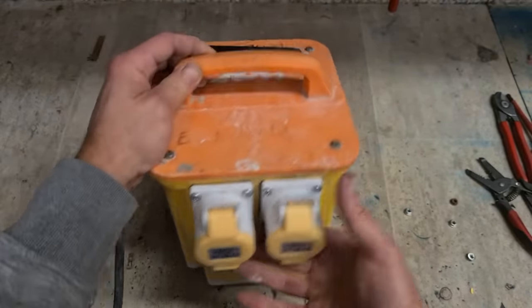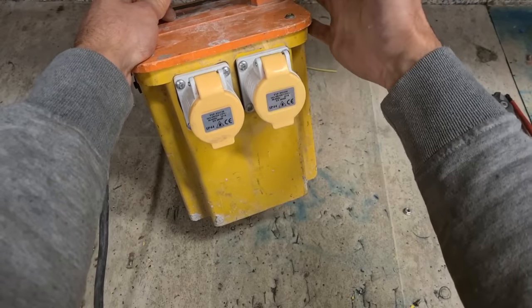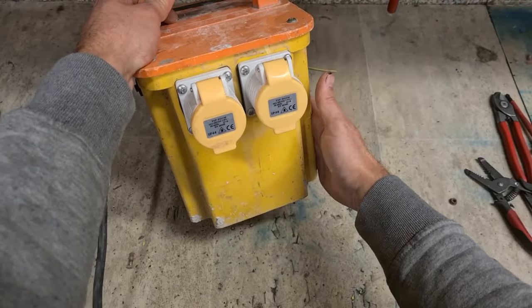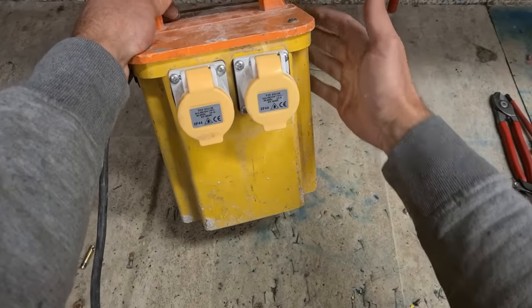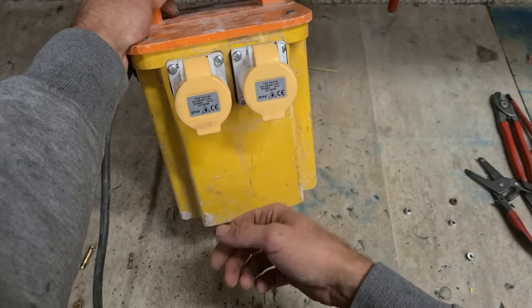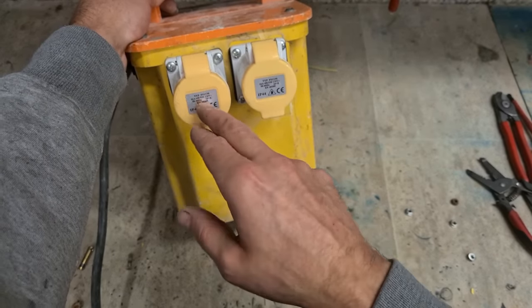volt out. So, lot safer for site work, so anybody using machines on site will have a 110 volt machine. This is what they'll be plugging it into. They have to carry one of these around with them. So that's why you see me working two different types of machines, two different plugs. The big yellow ones are for these here, these site transformers. So if you're working on a site with a machine, you have to have one of these here to power it.